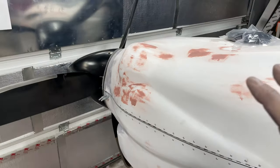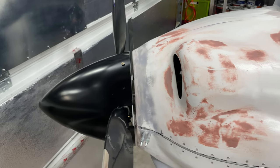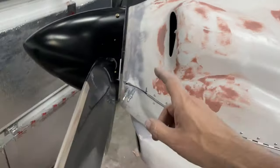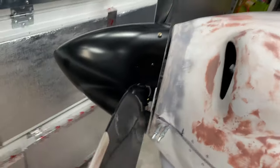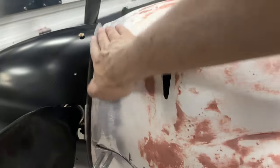We're closed up now because it started raining, but I did manage to finish blending the cowl up front and adding in the spacing. We used this pink foam — it's really high density, very light, doesn't weigh a thing. I glued pieces onto the front of this and then sanded and sanded and sanded. There was a lot of bodywork sanding in there. Once it was glued and sanded roughly to shape, I took some Bondo and cleaned that up.